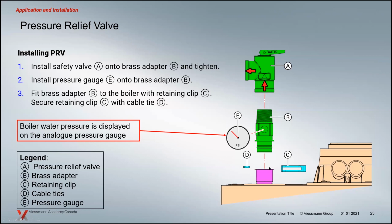I like that where it sits. Relief valve is obviously a nice spot there to purge the air out. And you have the clip here and a zap strap. So we clip this double O-ring fitting in, put the zap strap on it so nobody can unintentionally pull that clip out. And of course you've got pressure and that pops. That keeps that in place. And of course you thread your relief valve on and your pressure gauge.